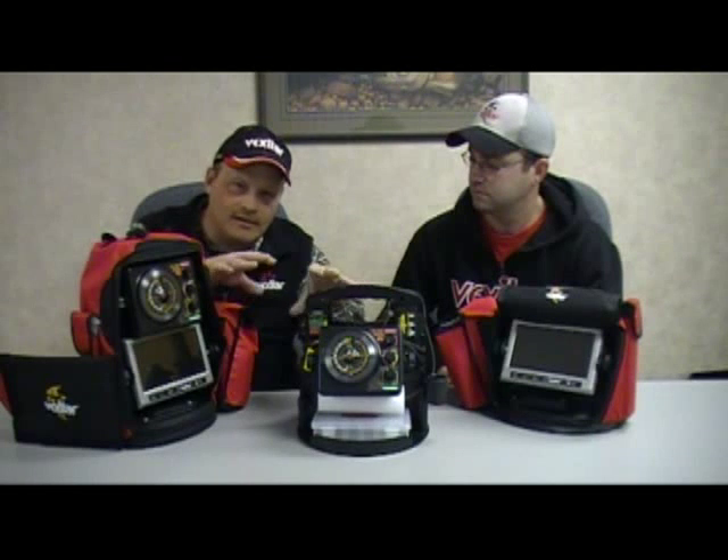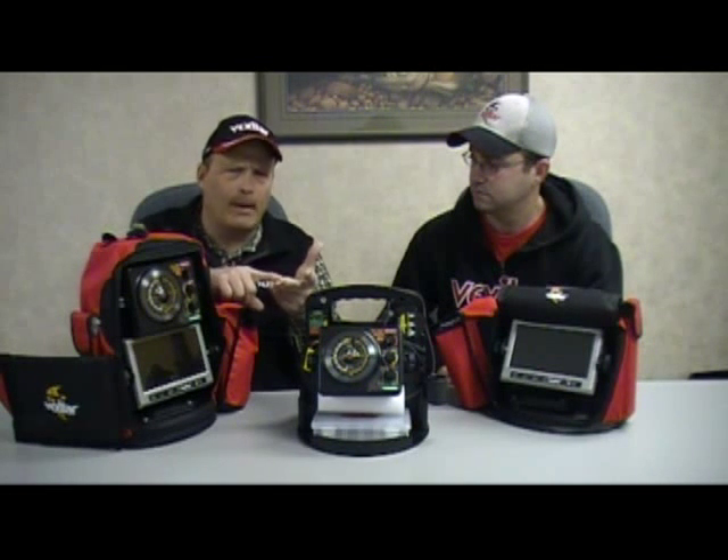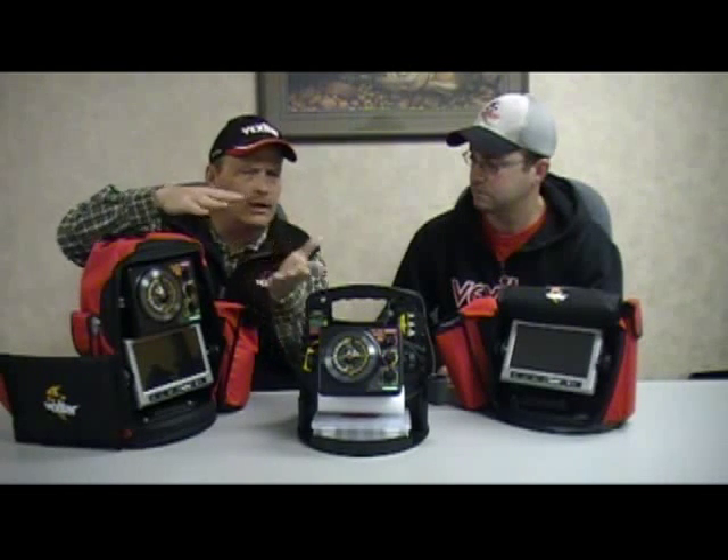We get a lot of calls from Vexilar fans saying, 'I see these flashes on the screen — I think there's something wrong with my Vexilar.' What a lot of people don't fully understand is that a Vexilar has less than one-tenth of one percent product failure. It's probably one of the most reliable, bulletproof systems on the market today. What it tells you is the truth — it's not lying to you. Because it's a sonar sound being translated into display signals, you're asking: is it weeds? Is it fish? Is it bubbles? Is it microcrustaceans or a thermal layer in the water column? Your Vexilar isn't broken — it's telling you something you haven't seen before.